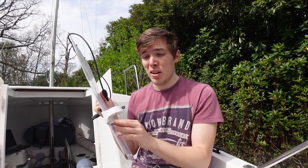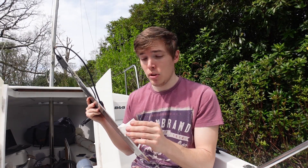The mounting has also failed on them. These are made out of PLA, made by Sam on his 3D printer and designed by Sam, and they failed only because they're PLA - the age and the water has gotten to them. PLA as a material isn't up to UV or water really, and it is biodegradable, so it's probably not best suited to marine grade. We'll be updating that with some ASA mounts that I'm going to print on my printer.